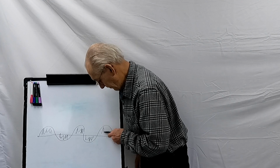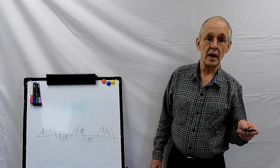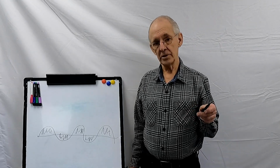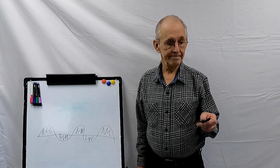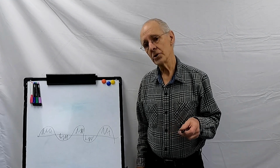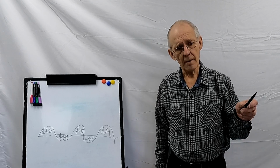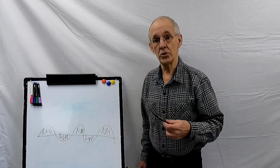Okay, so circuit breakers are a mechanical device, and because they're a mechanical device, they're not really instantaneous. It may take, I don't know, a 20th of a second to trip. Well, in 60 cycles, before that breaker trips, you're going to see 3 full cycles of energy.